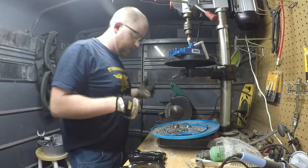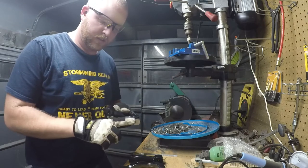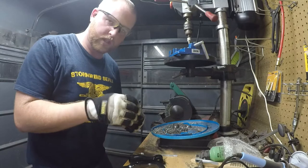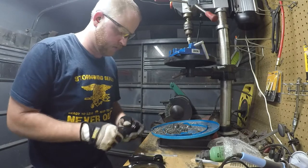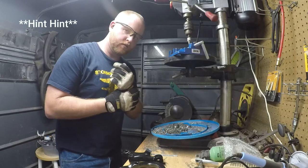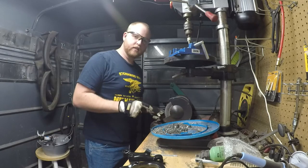We're out in the shop trailer. I just need to use the trusty bench grinder where I have it set up on my workbench. We're going to use this to bevel this, but we are going to leave the peak at the same height so I can know my measurement and have a nice tight point for the weld to bond into. We don't want to remove more material off the center than we need to, but the bench grinder is the most efficient way to do it. There is actually an announcement coming really soon - it won't affect the truck build, but any subsequent builds, and trust me there are some in the pipeline, will benefit from that announcement. Let's grind.